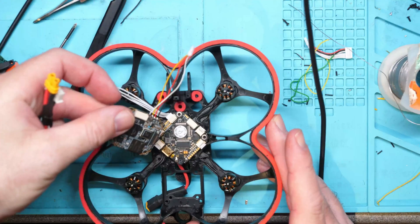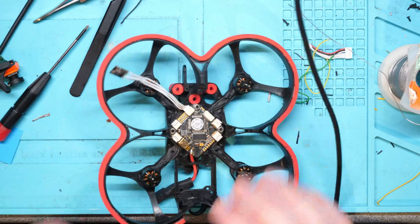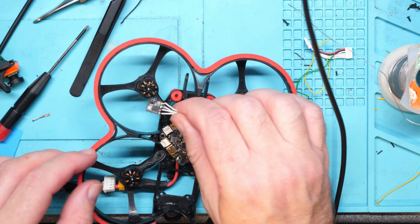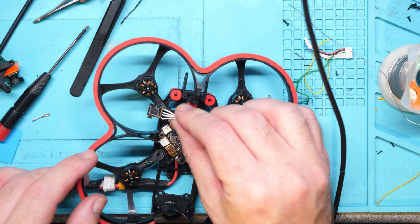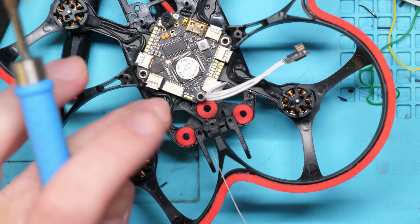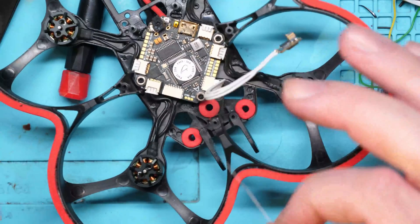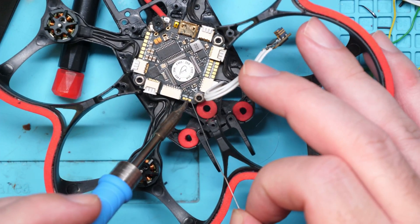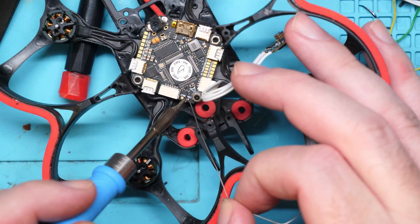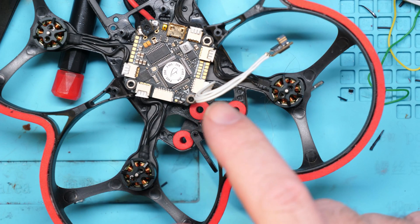The receiver is done, and the wiring on the VTX is done too. I'm not going to plug it in just yet because I need to find an antenna, but I want to first check I haven't made any mistakes on the receiver. I'll power it up and check for expected behavior. There we go — we've got the LED flashing, we've got power. Something I spotted in the manual is I need to bridge a solder pad because I've changed the receiver input type. If it's SBUS I don't need to do anything, but because we're using CRSF I need to actually bridge these two solder pads here. I've put some solder on and bridged them across to make sure they're touching. That should enable that type of receiver on the flight controller.